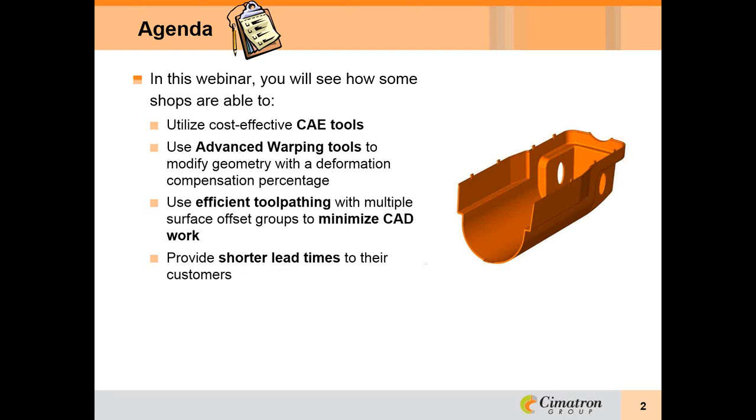Many plastic parts are challenging to mold within tolerance on the first, second, and sometimes third shot. Many factors affect the shrink and warp of the part. Because of the traditionally high cost of simulation, many shops still opt for machining the cavity to a steel-safe condition, molding the part, and then reworking the mold according to the deformation.